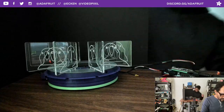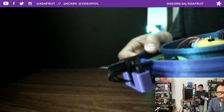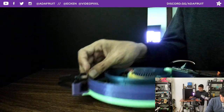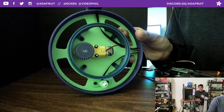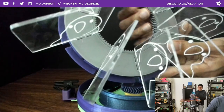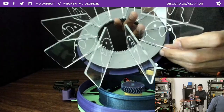This is going to be next week's project. Just a quick look — this is the encoder ring with a notch that passes through the T-slot photo interrupter. There's an IR LED in there and every time it breaks the beam that's how it tracks. The motor is just a TT toy DC motor, 5V. There's a 3D printed gear that press-fits over the motor shaft, and inside the ring the holder for the acrylic has a herringbone style gear.